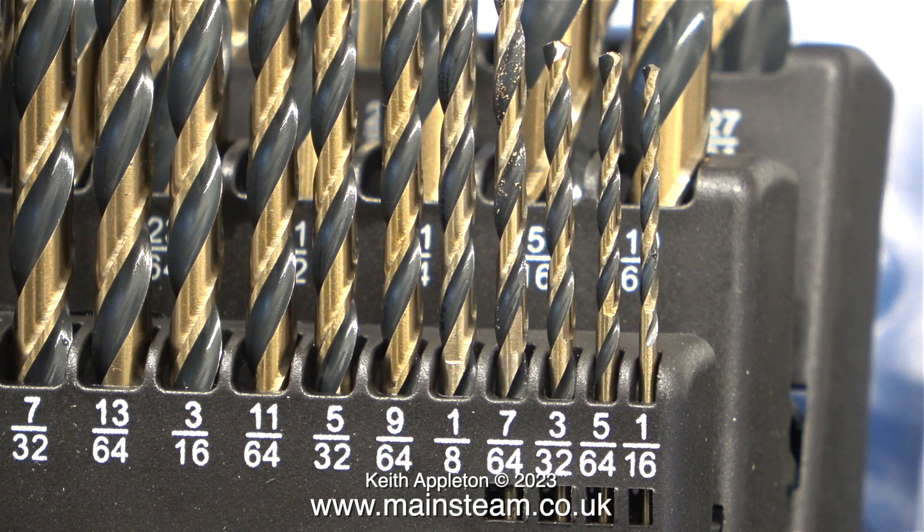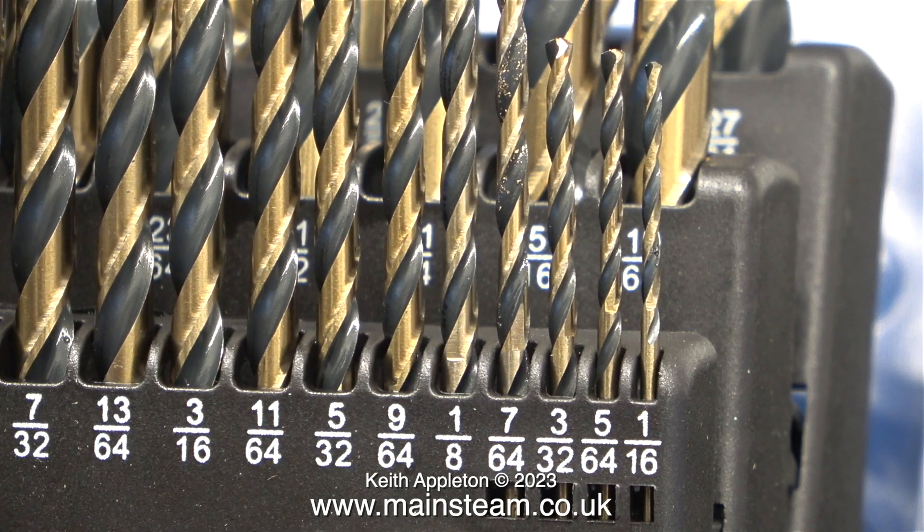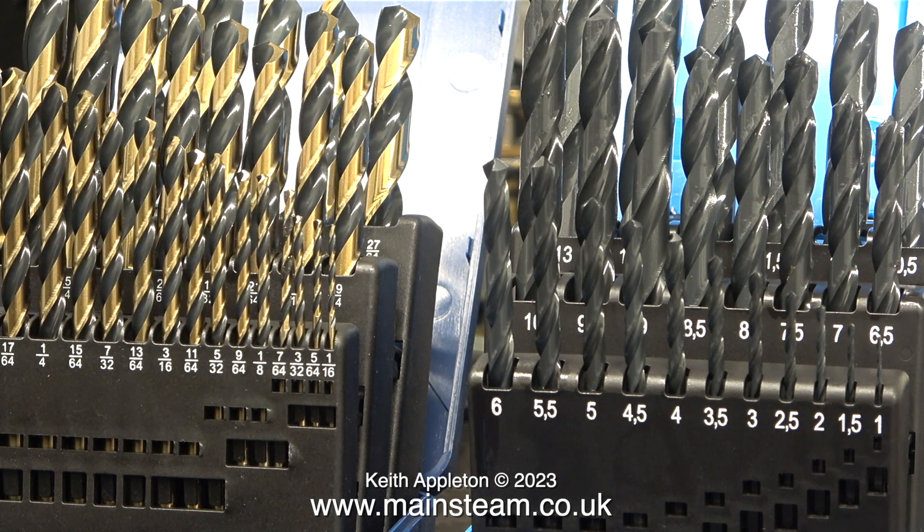The common sizes that I work with are ME sizes — ME stands for model engineering or model engineer — and BA sizes, which stands for British Association. The drill bit I'm pointing at is one eighth of an inch in diameter, and this is tapping size for 4 BA. If you open Google and search 'BA thread tapping sizes' you'll find quite a lot of information and you can print out charts and pin them on your wall. For ME and BA sizes I follow the teachings of LBSC from many years ago — he always said the tapping size was two imperial sizes down from the diameter of the tap. For a 5/32-inch thread, whether it's an ME thread or 4 BA, you would use a one eighth of an inch diameter twist drill for the tapping size.